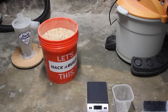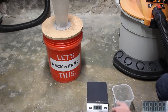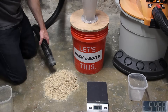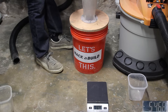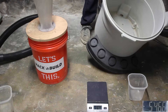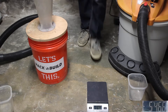I also wanted to see what kind of performance we'd get with the Dust Deputy when it had a really full bucket. I filled the bucket up with sawdust about two inches from the top, and also made sure to empty the vacuum from the previous test. We have 200 grams. From my previous experience testing the Dust Deputy, I knew a bit of sawdust tended to get stuck around the mouth of the inflow port, so I dumped out the sawdust on top to make sure it was accounted for. We collected 202 grams — I'm going to consider this 200 grams since there's practically nothing in the vacuum and the scale is only accurate to about 3 grams. It's pretty obvious that the Dust Deputy didn't suck any more sawdust into the vacuum.